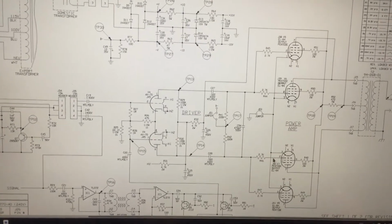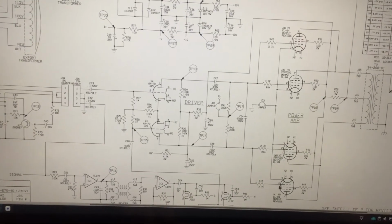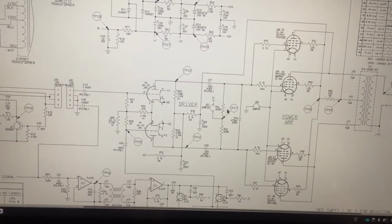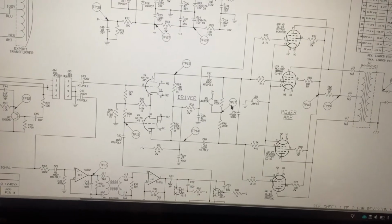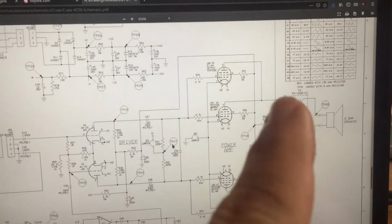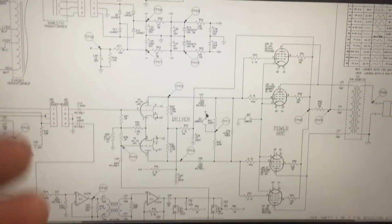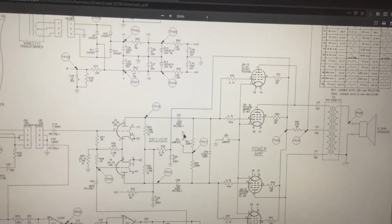And we've got this pin 2 down here connected through the same resistor, 2.7k, and another pin 2, 2.7k, and it's all going to here, and it's connected up to this little set of resistors here, 220 kilo ohm, 220 kilo ohm, and there's a test point here, test point 17, which we're going to look at in a second, because this diagram also gives us the voltages to expect at the test points. How good's that? But we've got a jumper here, and it goes to B minus. So that's telling us that this is a fixed bias, not cathode bias.